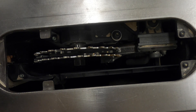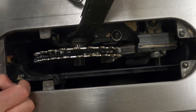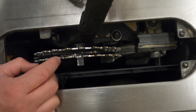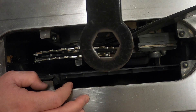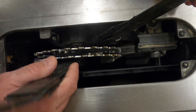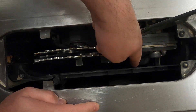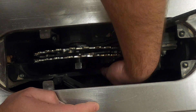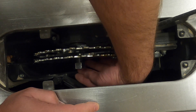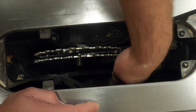Looking down into the top of the saw, we're going to change the blade to a different size. I'll take my two wrenches — the open end wrench goes to the motor side — and slide it down, turning the arbor so the notch fits into the open end. Then I take the box-end wrench on the nut, line them up, and loosen the nut. Once it loosens I can get in by hand through the little access door, then loosen the nut by hand. Be sure not to drop it into the saw, as it will fall into the bottom of the machine or into the dust port and be difficult to find.